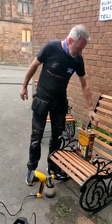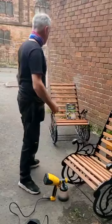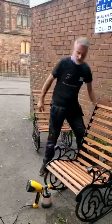Okay, so in this case we're putting on 2 coats of a proper preservative. Once that's dry, and there's a drying time for each one, probably 5-6 hours, then to seal on top of that, we're also going to put a couple of coats of decking oil. Now with those combined factors, it'll last a good time, it's going to look absolutely great, and they'll get many, many more years of service to come.